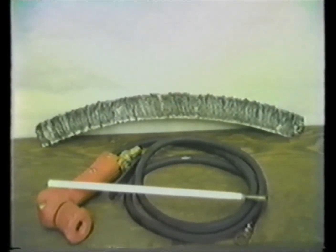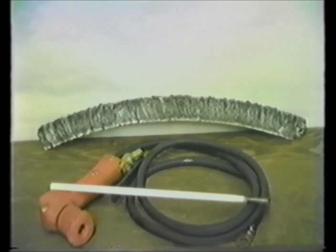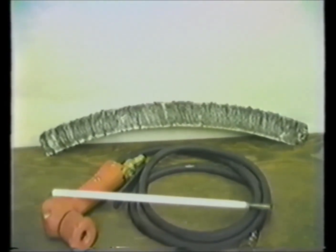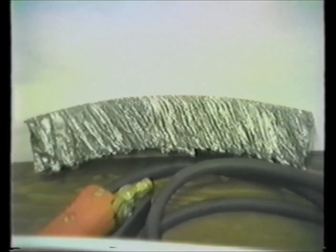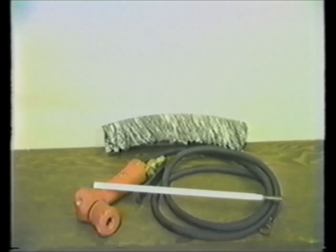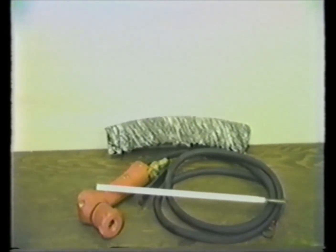This is a piece of inch and a quarter. You get a good look at the rod penetration groove there at the bottom. You can see the track of the O2 through the steel — that O2 is going to flow through the steel at the angle coming out of that rod. Now this is a piece of two-inch here. This was burnt with a very hot machine. You see just a very slight groove. This piece was burnt right on the edge — it's a very clean, fast burn, but any variation in that would have been lost.